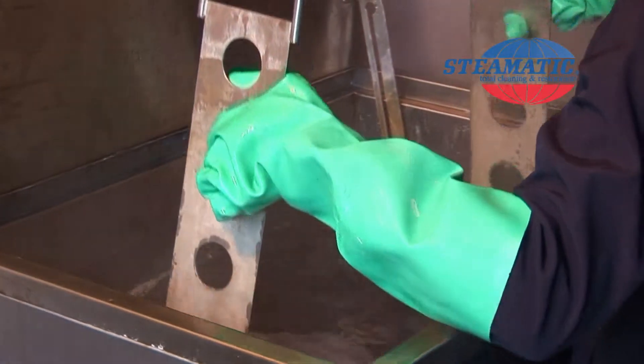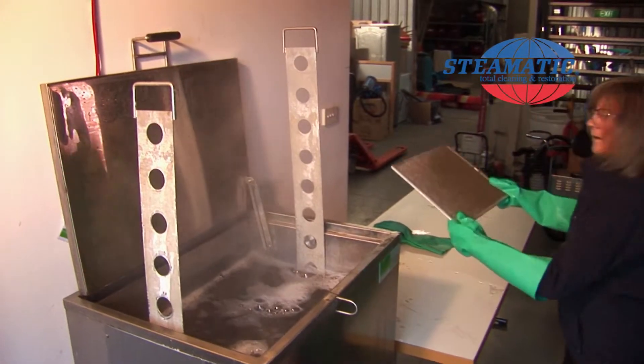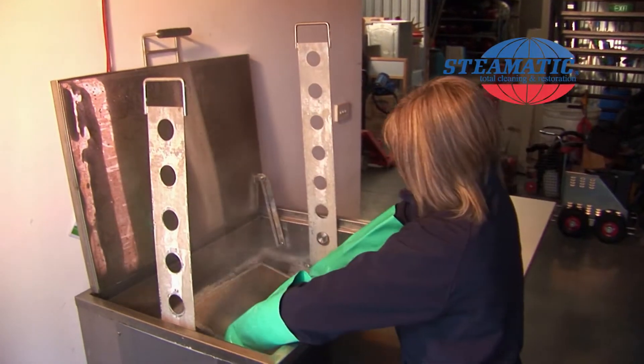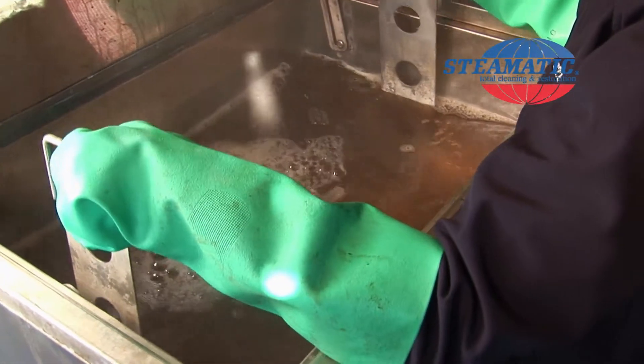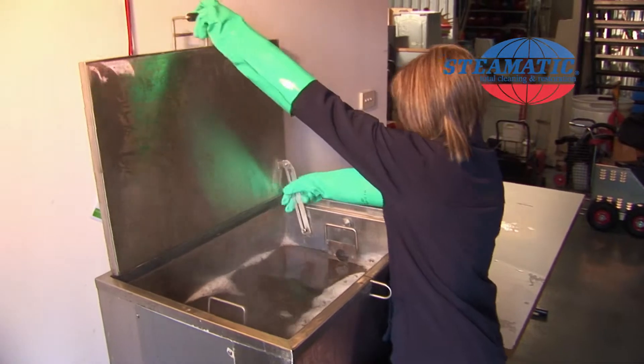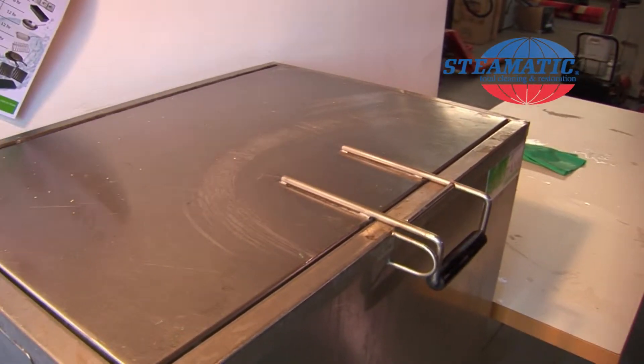The process for the Soak Tank — we just open up the door, pull the tray up, you lay your stuff on the basket, and you drop it down into the tank. It's about 1500 deep. You leave it for a period of time — depending on what you put in, you've got different times for it. You leave it in there for the approved time.